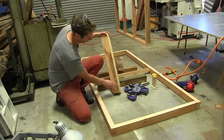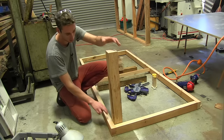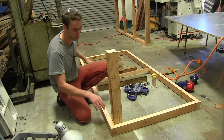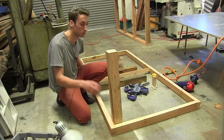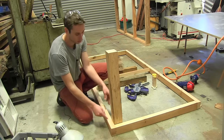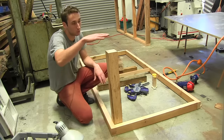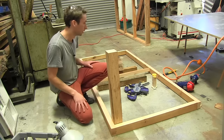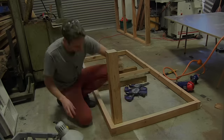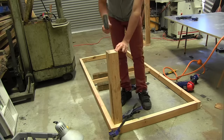The four legs have two square faces that go on the inside corners of the frame. The lower frame wasn't quite perfectly level, so I've shimmed the corners so it has no rock. When the legs are put in and screwed down, they'll be sitting on the floor and everything should be level once we put the top frame on — at least that's the theory. We'll glue it, use lots of nails, and clamp into the corners.